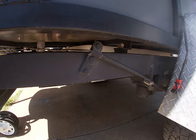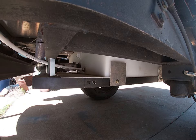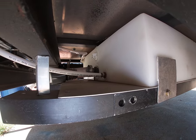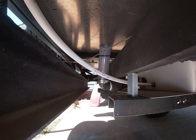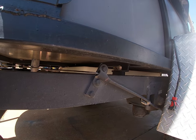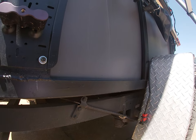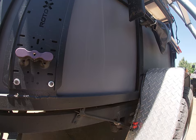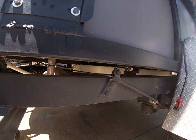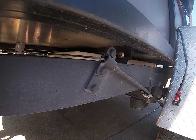The reason I chose the axle-less system is I wanted to put a water tank up in there and make use of that space. You can see the plumbing going up through the bottom of the box. The box is a framework of 1x2 rectangular tube, with eighth-inch aluminum sheeting for the sides and bottom. I used bed liner on the inside and regular paint on the outside, and I'm mounting it with half-inch grade 8 hardware — eight body mounts, four on each side.